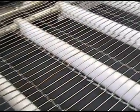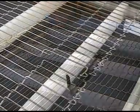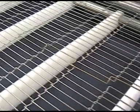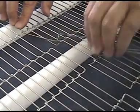We strongly suggest that you straighten the strands as you go. And once again, we've completed the splice. We're not making this suggestion just to be neat or compulsive. A bent strand will wear on both the belt and the drive components and can cause a break in the belt at or near your just completed splice and even seriously damage your conveyor, setting you up for major problems later on.